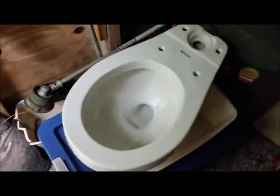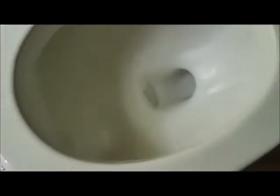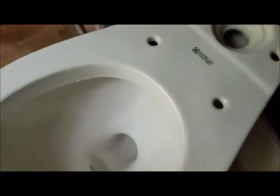The 1970 Cadet Bowl has been acid cleaned once again. I poured the acid down through here, made it fill up into the bowl, then lifted the bowl up and let the acid go into the siphon jet for a little bit. Then I kept tilting the bowl on its side so that the acid would go up into the rim. I did see a lot of fuming during that part, so maybe there was something up in there that the acid was eating away.